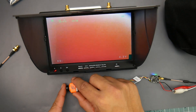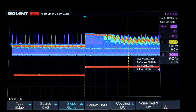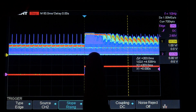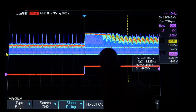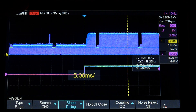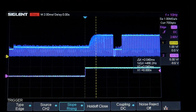It's working as it's supposed to and it's actually pretty responsive. Let's take the camera apart and check its latency. So let's take our first samples from the camera that comes with the FXT gesture box. Up top we have the video feed and on the bottom we have the LED. We're testing both when the LED turns on and when it turns off, and we can actually see the change in the video signal. Zooming in, we can see the point where the LED went on and where we actually saw the change in the camera.